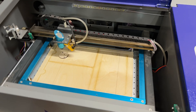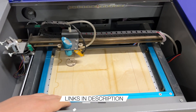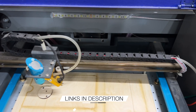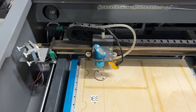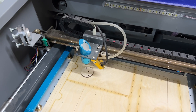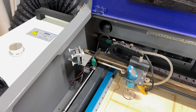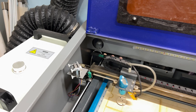Over here in the laser you can see there's been some changes done. This is the adjustable Z-bed. I've removed the back shroud for the fan and also I have an air assist nozzle on my laser — that is a CloudRay nozzle and lens holder, and it works great. I am missing a little bit of the hot glue because I've had to redo some adjustments to my mirrors, which we will go over in the next video.